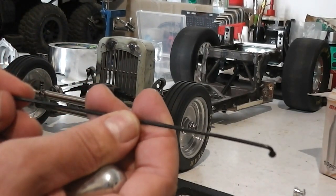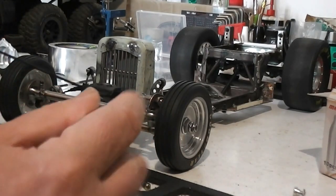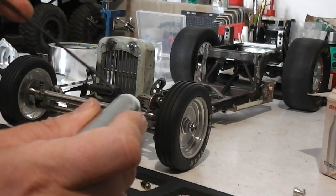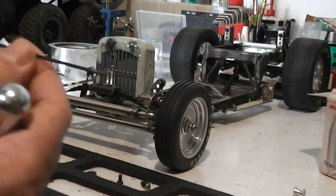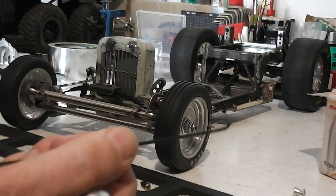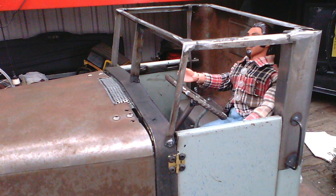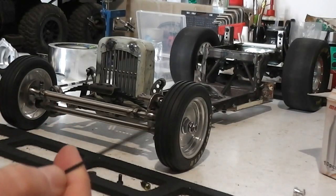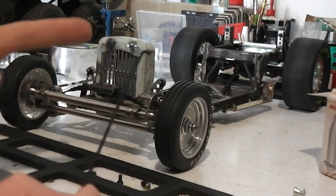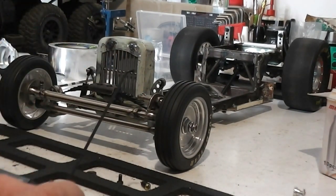this, which is a bike spoke. Drill a hole in here, thread it through, and plug weld it from the other side. This is really small stuff, man, but I have welded it before. I've used it for the handles on the side of the Fat Betty truck. And you can weld this. You just have to leave yourself a lot of meat because it disappears real fast. So you always make it longer than you need, and you just get in there real quick with the welder.